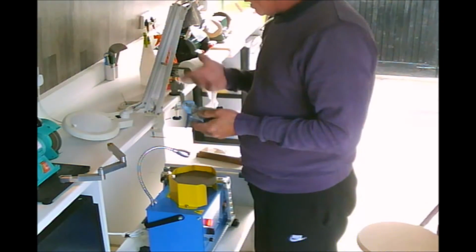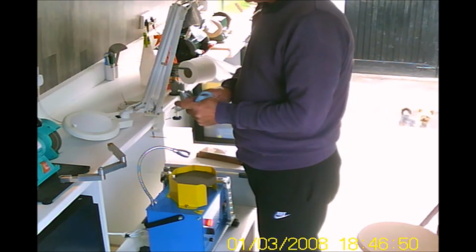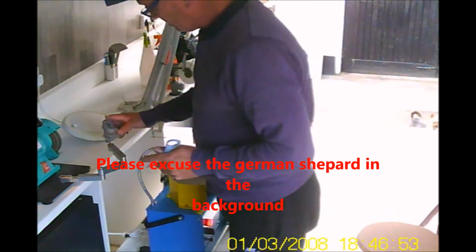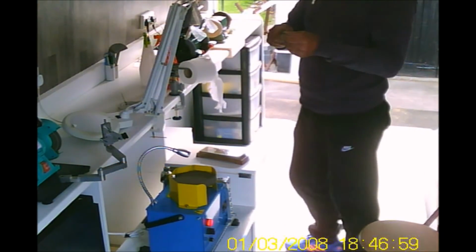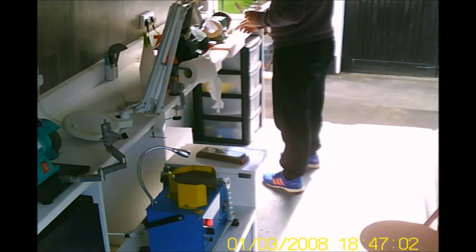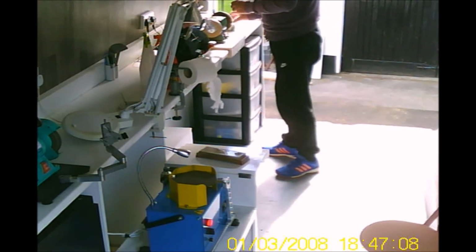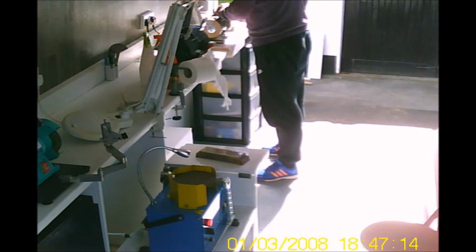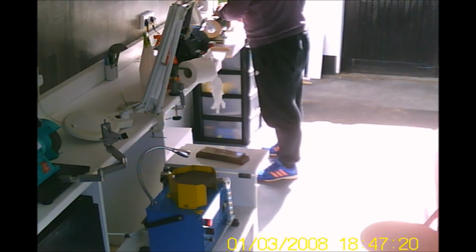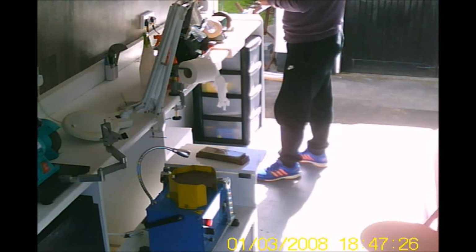Once we've got to that point and everyone's happy, what we'll do then is we'll release the scissor blades from here. Turn this machine off because we don't need that one now. And if we want to give these a final polish up, we then come up to the leather wheel. Just here, green paste, and there like that, and then we will give this a quick polish up. Woof, that's sharp.